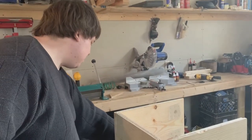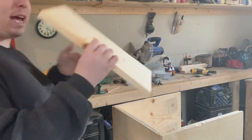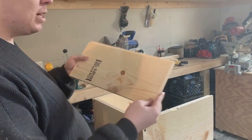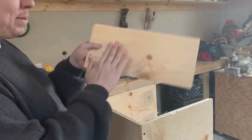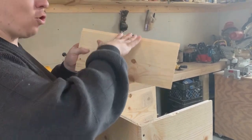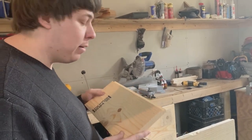One important thing to mention: when you're putting the six and seven-eighths board on the bottom side of the swarm hive, make sure the rabbet step is facing up. This way, if it rains and water gets into the crack, it will not be able to get inside the hive.